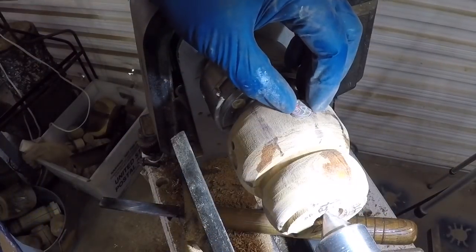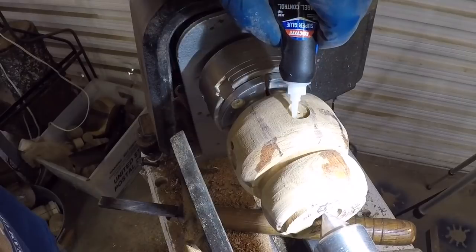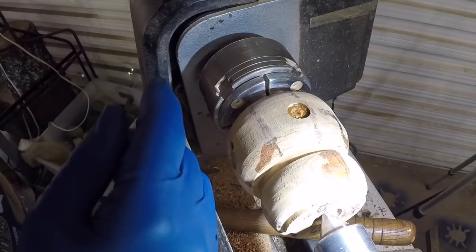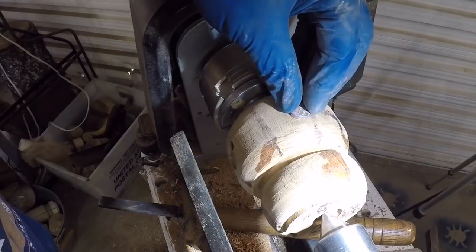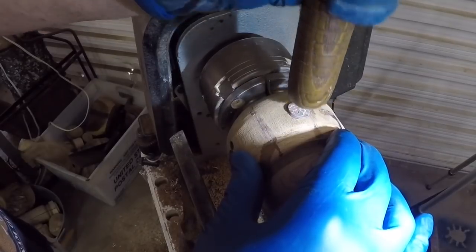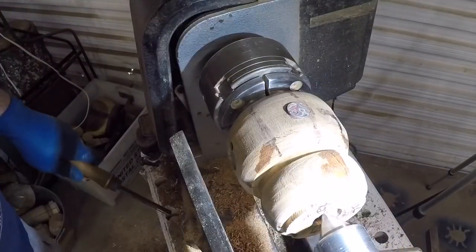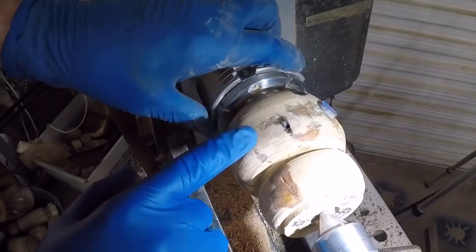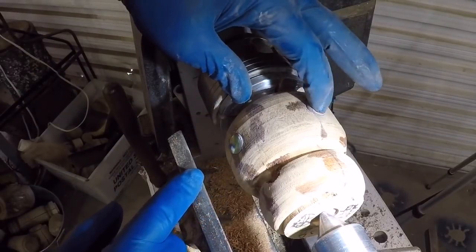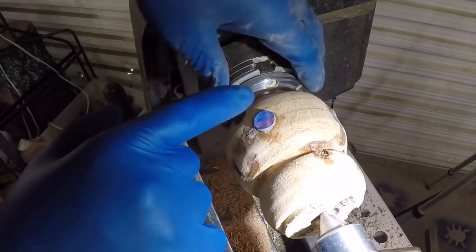I've got a good fit with these little chips. I'm going to use this Loctite CA medium gel because I want to fill up the cavity pretty good and have it flow up around these little insets so they're nice and stable. I just pop them in and use a little helper to get them to go flush down inside the hole. I'll do all four of those. I got them all set in here with the medium gel and I'm going to let that sit for a good while, then take it over to the sander and take these down as close as I can so I don't chip them out with the tool.